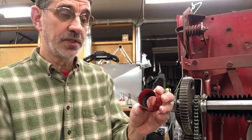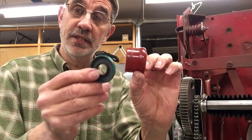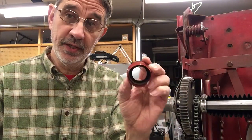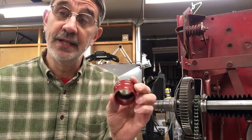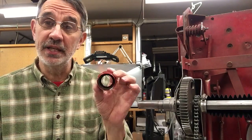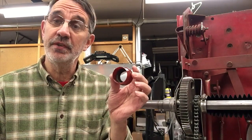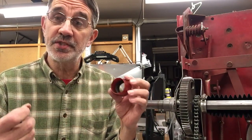The newer style is shaped a little weird. It's kind of hard to get the seal in there because it's so stiff — really stiff. But in one of my videos I show you how to do this very simply. You take this, drop it in a cup of hot water — not boiling, just hot, maybe like the temperature of a nice cup of coffee. Leave it in there for a minute and you can pull that seal right out.